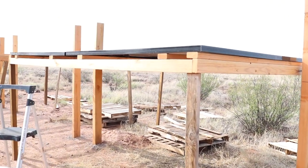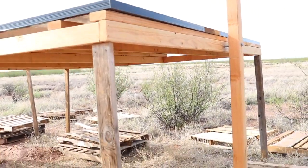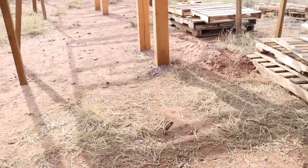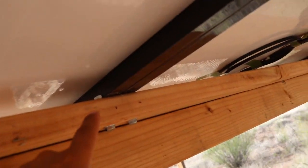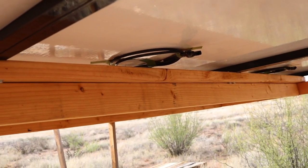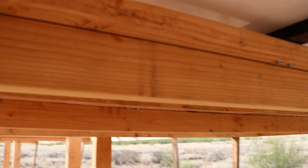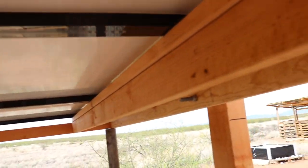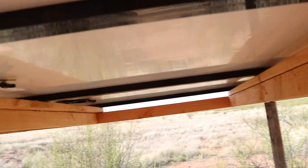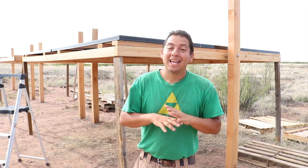I got the framework done and the boards that the panels attach to. I attached the panels using a combination of lag screws and bolts, stationed at four points on each panel. After mounting these, I also added support boards under each of the wood mounts to give the boards a little extra support for holding up the panels.